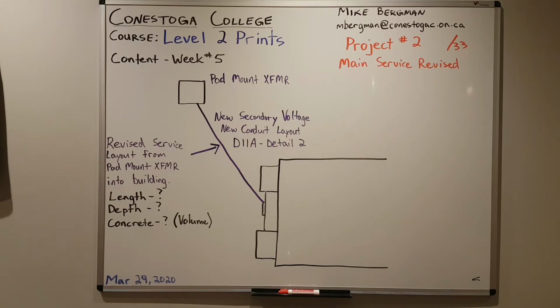That's that thin-walled conduit. I showed you an example of that in class with the racks, or the chairs they might call them, to hold the conduit in its proper configuration. They would like the service to be run in DB2 conduit. It's going to be encased in concrete, so when we're running this thin-walled conduit, it needs to be encased in concrete for extra mechanical damage, or to provide mechanical protection against any damage.